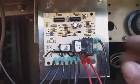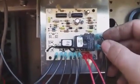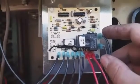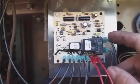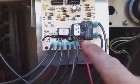This is our defrost board all wired up. Our two wires for the outdoor fan motor contactor — these are low voltage on this particular setup, which is how I designed it. Because it's a three-phase motor, I figured this would be the easiest way to do it. Our defrost thermostat is located back in the back there.